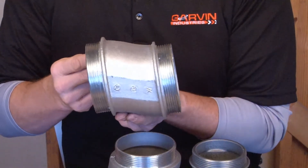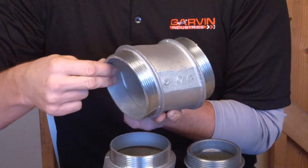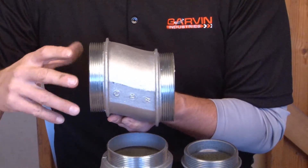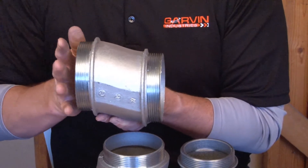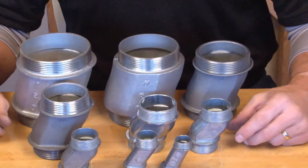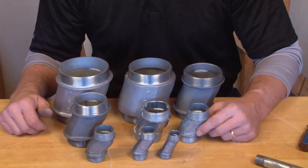As you can see from the four inch sample, there are smooth machine threads on both ends so that a lock nut can be turned on quickly and easily when installed to a coupling or connector as well as to the junction box. They're made from cast metal and zinc plated for corrosion resistance in just about any job site application.